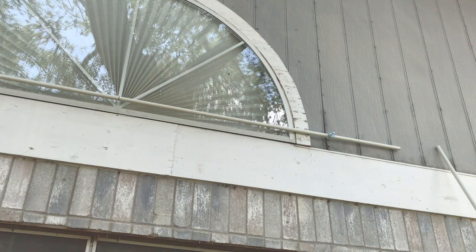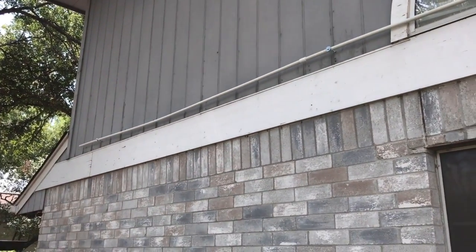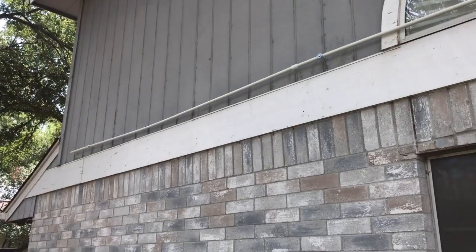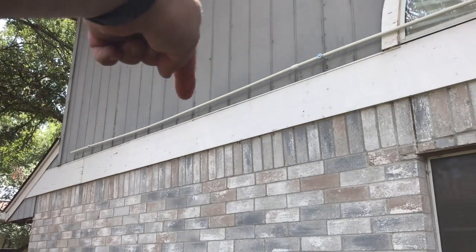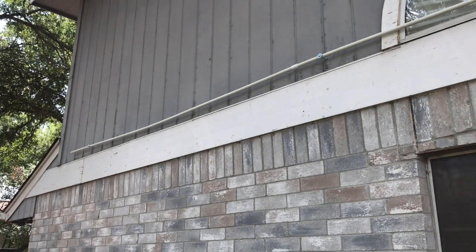And it also occurred to me that I'll probably need to put a piece of wood or something in between the PVC and the wall because of the wood and the paneling. And then now I've gone further down with another piece. So you can see just the PVC itself has a little sag right here. I think I'm going to go with 3 of those mount points per 10-foot piece of PVC.